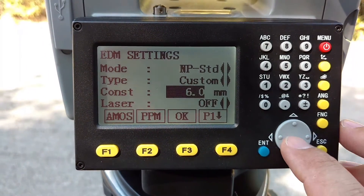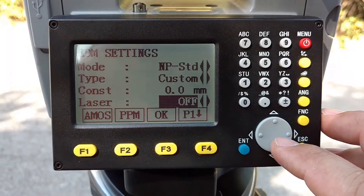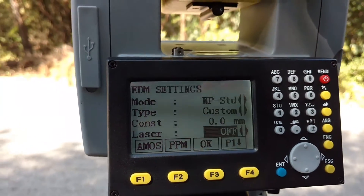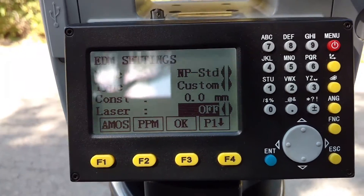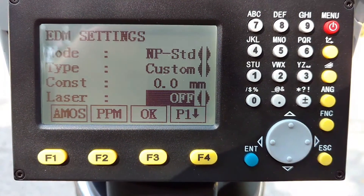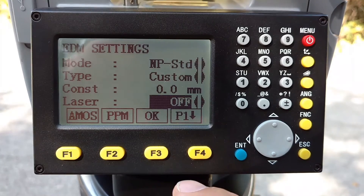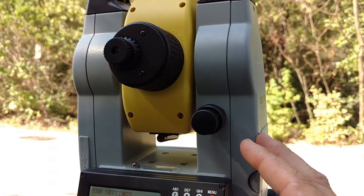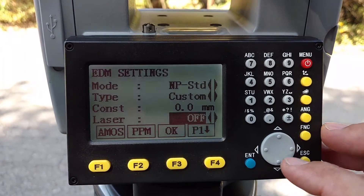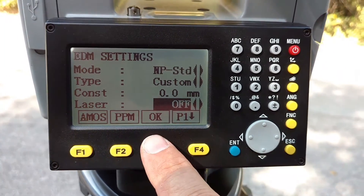Laser — this is the viewpoint of the laser. You'll need to hit Enter to accept the change. The laser is the visible dot you can see; I don't recommend looking into it directly — you will burn your cornea. You can have that laser always on for this prism setting if that's your preference. I actually probably should have this on because when I'm in non-prism mode, I'm using that laser more than not. The spot laser on this gun is super bright — you can see it when the sun is out here in Texas. You can just turn it off and on for this setting.